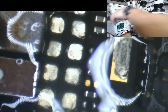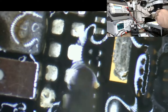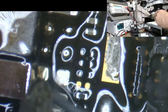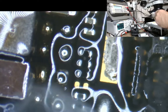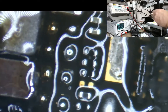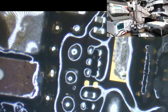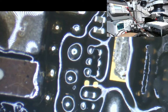Okay. This board will work without these components, you know. This is why people don't put them on. It will work, it'll just be a little bit less stable. Right. So what we've done there, we've just added a tiny bit of solder, a little lump, a little bump to each one of them.